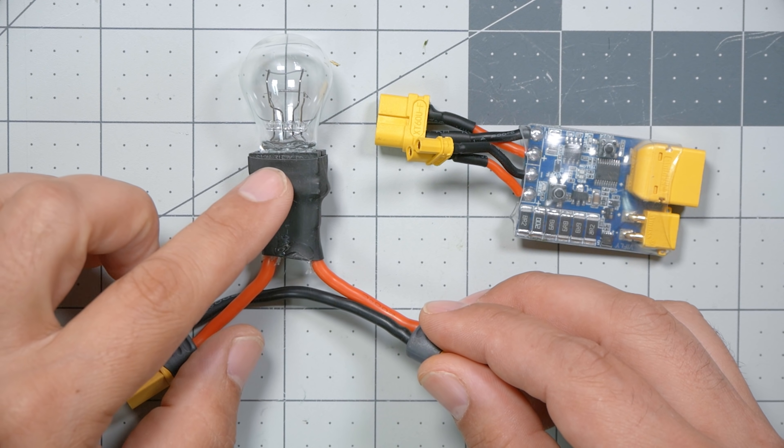On 3S or 4S, the light bulb will let about 2–3 amps flow even in a fault condition. So if you plug in a quadcopter with a light bulb smokestopper, you'll see it light up — boop, boop — but the quadcopter will probably stay powered up and you won't be so confused. The main time to worry is if it just lights up blazing like the sun and stays there. But with solid-state smokestoppers, as soon as anything trips it, even for a fraction of a second, the whole quadcopter shuts down.